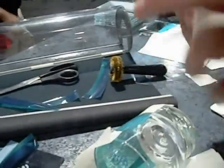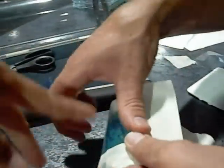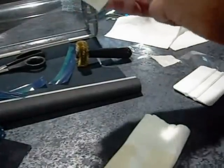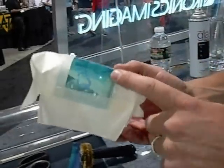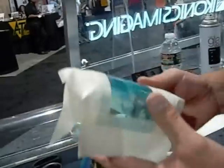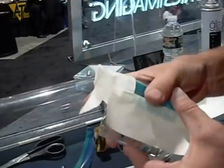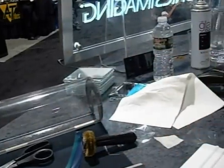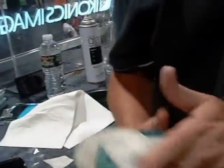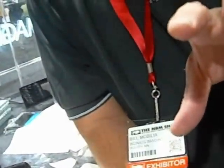And how old is this technology? Not your specific model, but the whole technology of doing it this way. So resist films — this film is about seven or eight years old. But I've seen over there, on some of the machines, it says since 1963. So what were they using then? The company used to have a liquid emulsion, almost like screen printing emulsions. They would screen it and let it harden.